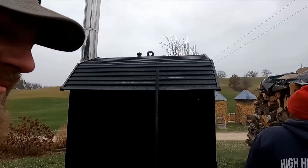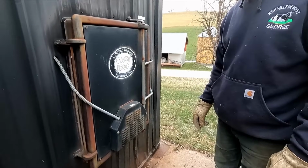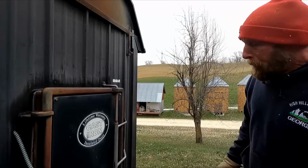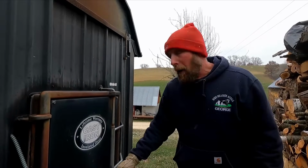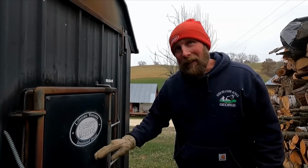So what happened here is this solenoid, I want to think this is my second one, maybe third. They claim you should put penetrating oil on them and stuff. But it's not in the best environment because of the heat and the dust. The aquastat would say it's hot enough, so the buzzing would stop, but the flap would still be stuck open. So at times I got to do that, and then I hear it snap shut.